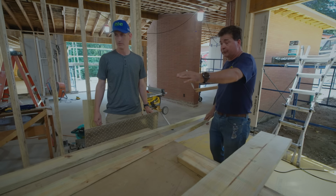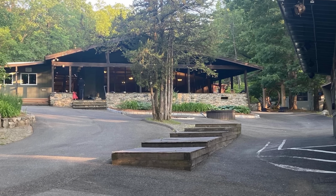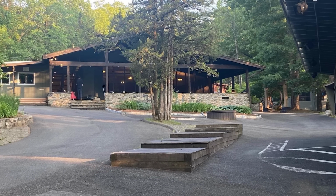Right, so I saw the picture that you had sent, and I saw the 10-inch rise, and to be ADA compliant with a 1:12 pitch, which means every foot that we come out, we're allowed to drop 1 inch in elevation. So that 10-inch rise means we have to come out a minimum of 10 feet. So that'll give us our ramp. And there should be plenty of space in this location for a 10-foot ramp. Yeah, when you sent the picture, it looks like we had plenty.